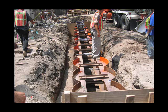There is a practical limitation — 90 feet is considered a reasonable limit for the length of these drilled shafts. It's impossible to ensure that each shaft is 100% plumb, so to allow for some small amount of out-of-plumbness, you should limit the height to 90 feet. Within that height, the shafts will always be in intimate contact.